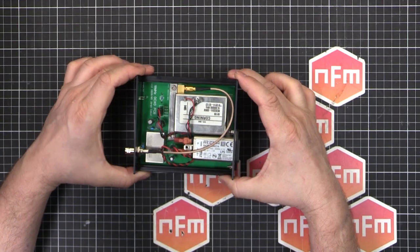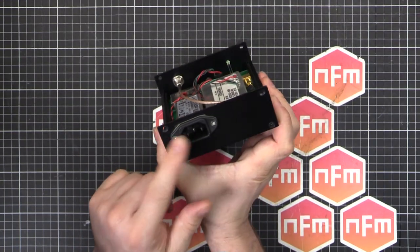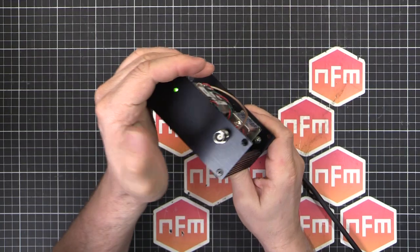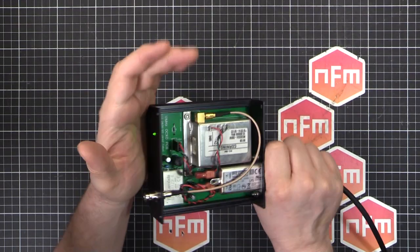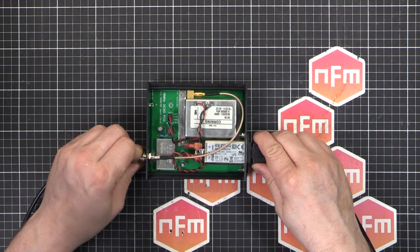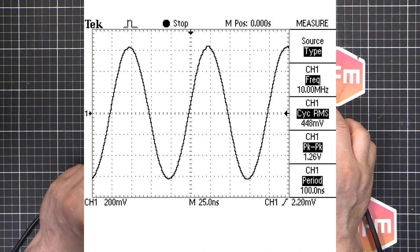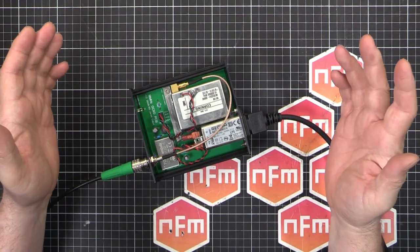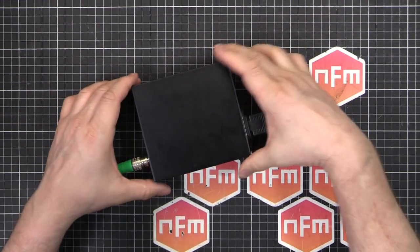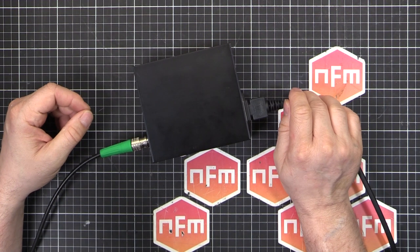Apart from that it's exactly the same, and we're ready to turn it on. You can see on the front there's the LED and the BNC jack - just drilled some holes and mounted them. On the back we've got the power inlet. So let's plug that in. We've got a green LED lit up - that means we're getting 5V and by extension 15V, because the 15V is running from the 5V power supply. And if we plug that in you can see on the screen: 10.00MHz. Perfect. Beautiful sine wave, 1.26V. Nice signal. That is good. So we're done, all finished, that's good to go. We'll put the lid back on with 4 screws, and that is a nice module that will sit on my bench and be used when I need a 10MHz reference that's relatively accurate.